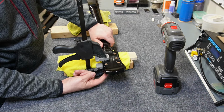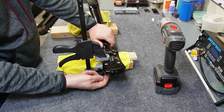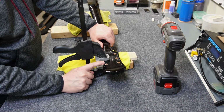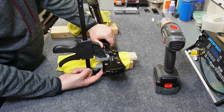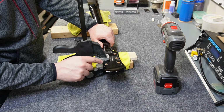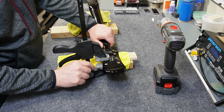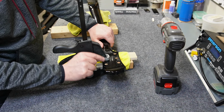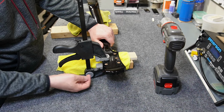And the reason I want to do that is because I really want the front of the headstock to keep the original size hole and the back of the headstock to have the larger hole. The ferrule for the new tuners actually fits into the original hole, but the body of the tuner does not. And so that's sort of the best of both worlds. It's the least amount of space that the backside needs and the least amount of space that the front side needs.